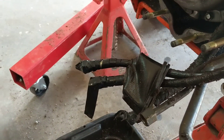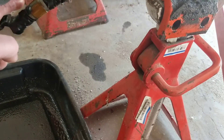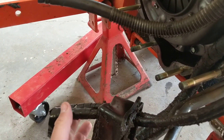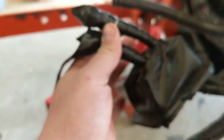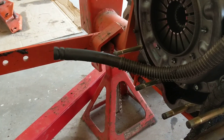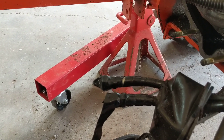When you split these, because this tractor has hydraulic steering, you need to pay attention to your hydraulic lines. The main high pressure feed is the bigger one, and there's a rubber hose that's your return. But pay attention to those two — they're the same size. What I did is I just left them in the rubber boot. It's a bit filthy because I tried degreaser, plus hydraulic fluid leaked out as I took the lines off. But leaving them in the boot means I know which one is which — swapping them would make steering work in reverse.